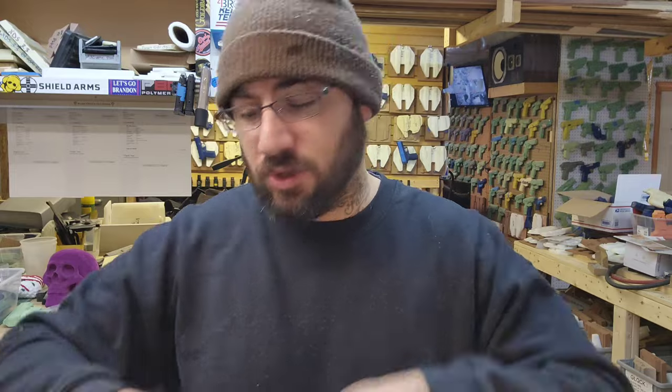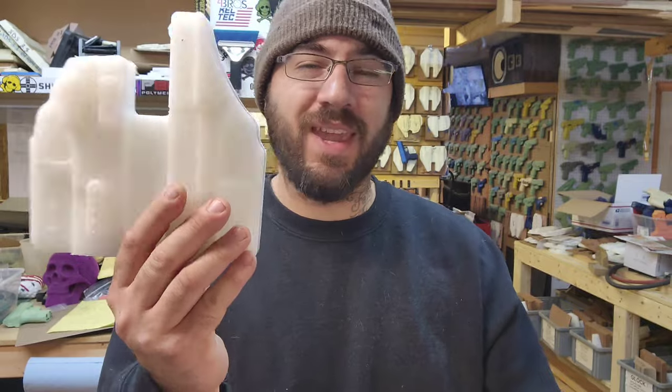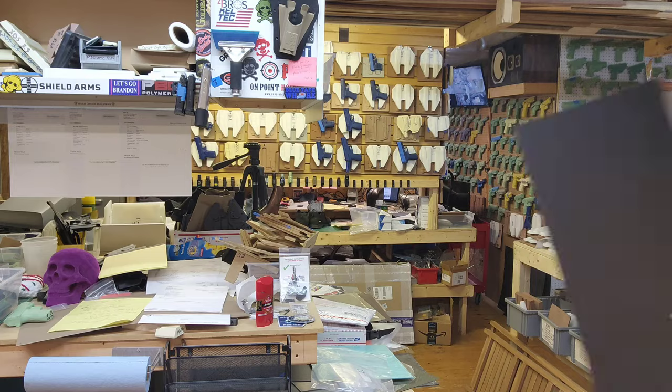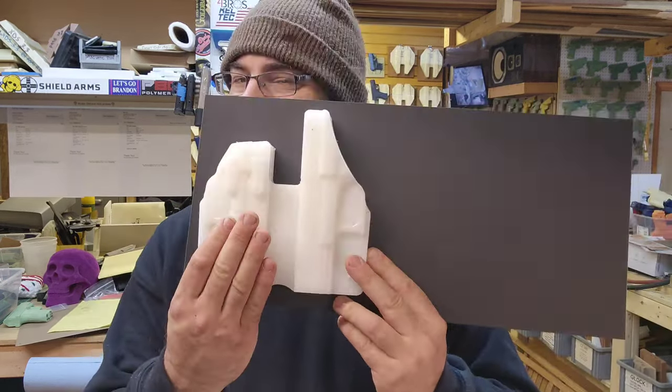Awesome part is, with this particular setup, you don't need to use a 12 by 12 or anything ridiculous size like that and waste a lot of material when you're vacuum forming, because you've got to create the seal. This only has to be big enough to just fit within the HDPE mold itself. Now, we're going to use an 8-inch by 8-inch piece. I don't have it cut now, but I do have an 8-inch wide by 16 that we're going to cut. And as you can see, not a lot of wasted material, which is absolutely awesome. And eventually this mold pays for itself.